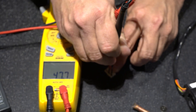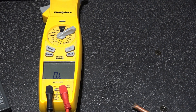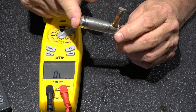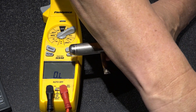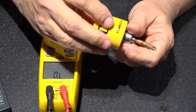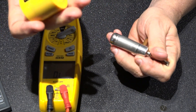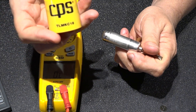If this tests between 40 to 50 ohms, then this power head is going to be good. Now there are several ways to try to open up this valve. I've got a couple of tools I use. There's one that works on some EEV valves but does not work on the ones used in Amana and Daikin equipment - it's one put out by CPS. It's got one large magnet inside and it slides over the EEV valve so you can turn it clockwise or counterclockwise to open and close the valve. I've had success with this on other manufacturers' valves, but it does not work with the Amana or Daikin valve - it's the CPS solenoid magnet.